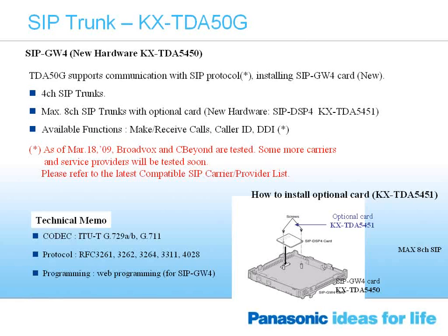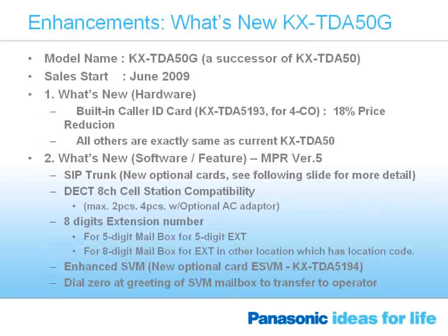Once programmed up, you can have up to 12 standard incoming lines plus up to eight SIP lines, taking the total number of lines on the switch to 20. A SIP line is much less expensive than a standard telephone line from a traditional telephone company and offers features such as DID, meaning you can buy a block of numbers and everybody on the switch can have their own telephone number. It also carries name and number caller ID and provides outgoing name and number caller ID. We're using standard codecs that most current carriers provide, so you just need the card, and simply contact the carrier to get set up.